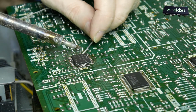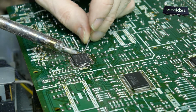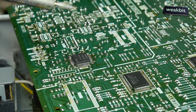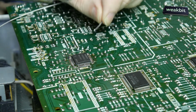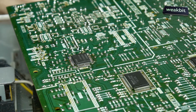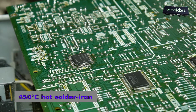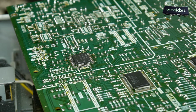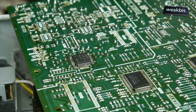It's a big soldering iron. If you have a shock like this, no problem. I understand all people think you must solder this with a small soldering iron, but it's not true. You must have a very hot iron, 450 degrees Celsius, then you can solder this. If not, you fail. You have no connection and no contact. The industry solders with 500 degrees Celsius, 480 to 500, in a special hot but short time like this.